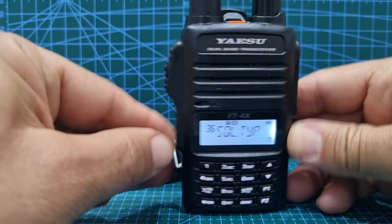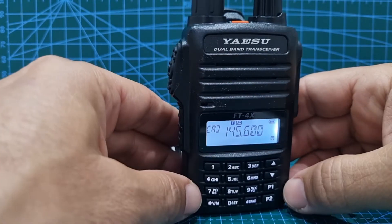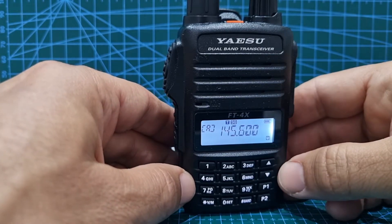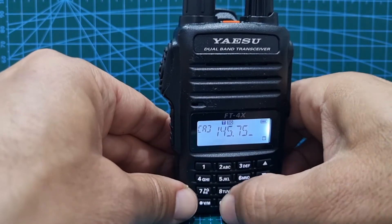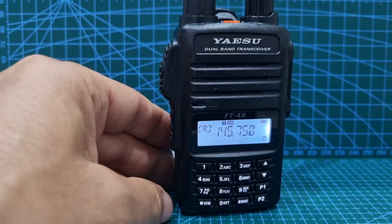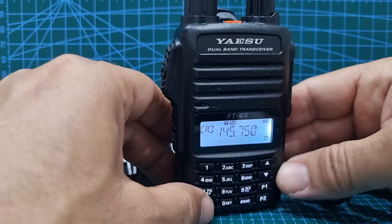So let's come right out. We're back onto the normal screen. Let's make sure we're on VFO A and type in the output of the repeater that you intend to use. We'll change it to GB3BC here, which is 145.750. And then I've just shown you how to set the tone, so do that as well. We've turned on split mode. Now go to B-band — push the V button here.